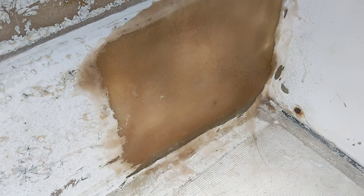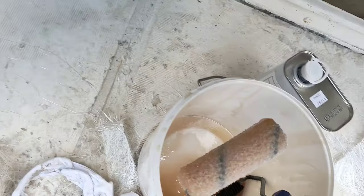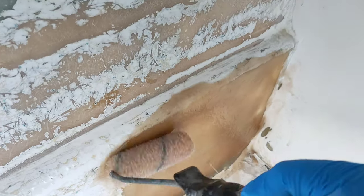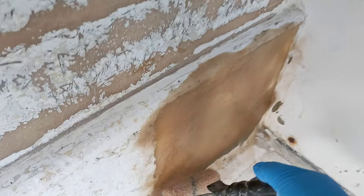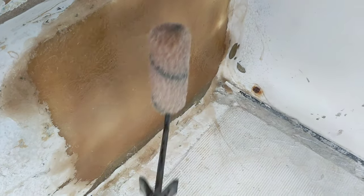Now, when you finish going over with your consolidating roller, you're then supposed to take your fluffy roller and just go over again, like one last time, and just check it, make sure before it goes off that you're happy with it. And after the consolidating roller, this just fluffs it out. Because the consolidating roller picks up little hairlines, if you like, and leaves them poking out. So